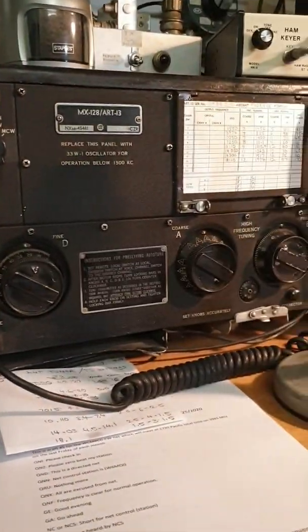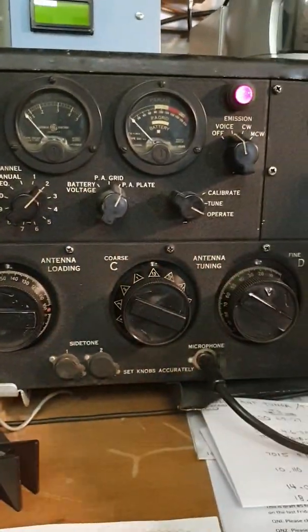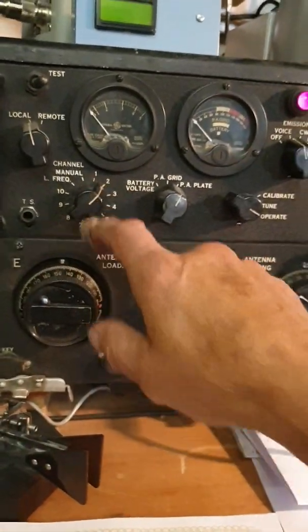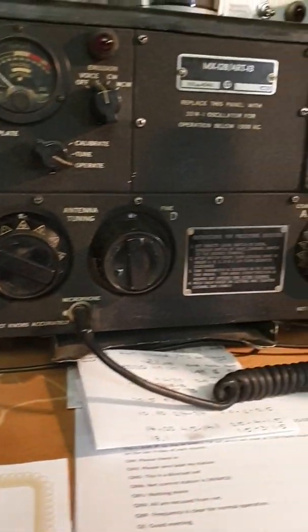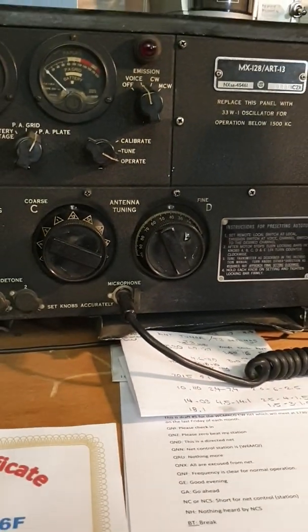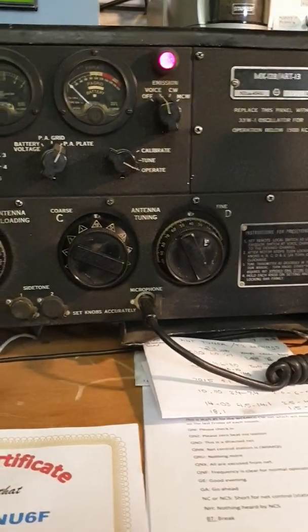This was the first auto-tune radio that Collins made, and it still had frequency stored in it from World War II. Right now I've got it set up on my channel 2, which I've got set up for our AM military net. If I want to go to work CW on 80 meters, I go to channel 1, and you'll see that the auto-tune, the red light goes out saying it's out of tune. It'll reset all the tuning controls back to the 0 position. Then the clutches engage to where I last engaged them for that channel. And it sets everything to where it's supposed to be. When the red light comes on, it's ready to transmit on frequency.